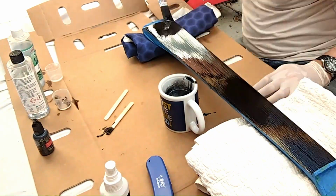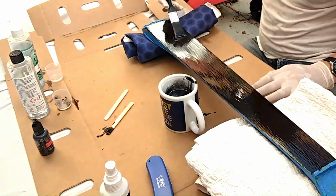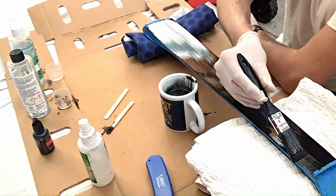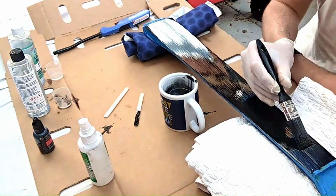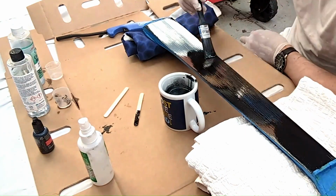With epoxy, in general, we have one enemy, air bubbles, especially when you apply epoxy that thin. Whatever you do, do it slowly and think of anything that might push air bubbles into the mix when pouring, when mixing, dipping the brush, brushing itself, everything in super slow motion. Try to brush on as evenly as possible.